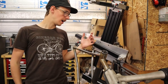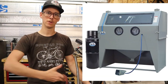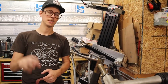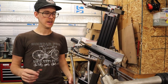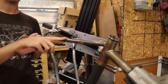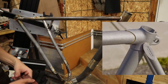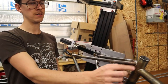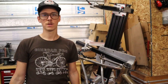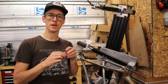Ideally with a frame like this you would sandblast it. A sandblaster is an enclosed thing with ventilation to pull the dust out, and you have sand or other media — like walnut media or glass beads — recirculating in compressed air on a venturi. You're abrading the surface, removing mill scale, rust, and different things, giving you a uniform gray texture. I don't own a sandblaster — I used to work somewhere that had one, but I don't have access to that anymore. So I'm doing it with really low tech stuff.